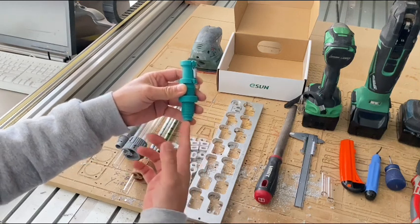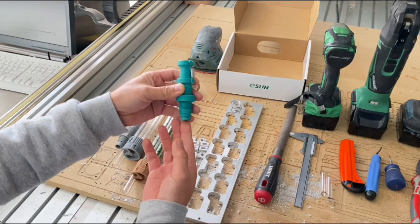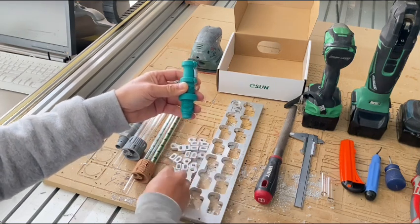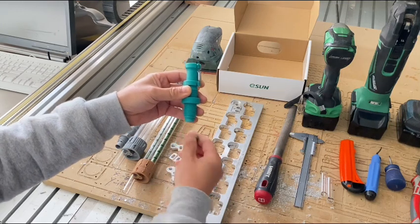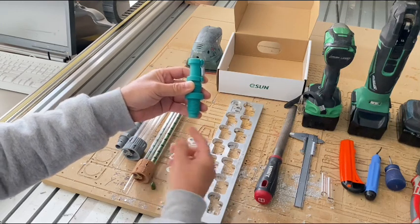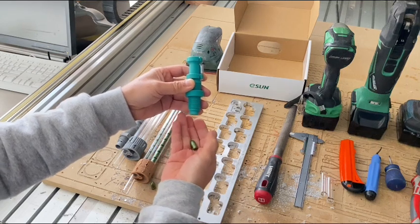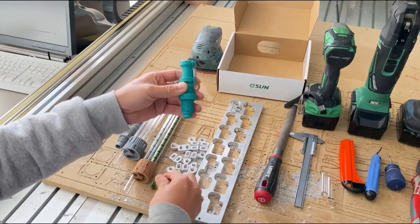You can see the spring — when this goes up a little bit, the projectile will come out. Once the projectile comes out, the case moves to the next station. The next empty case comes here, pushes again, and the projectile comes out. That's how it works.